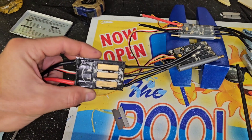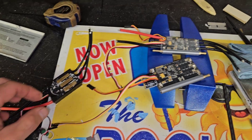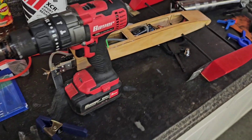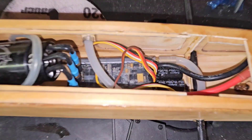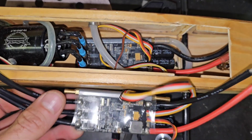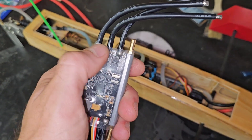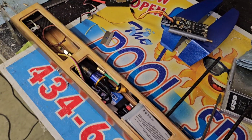I also had a Fly Color 90 with the cooling block removed — that's what Big B runs in his. In my main original rigger, that's the ESC I run. In this rigger right here we've done 91 miles an hour with it. I have the Kraken 120 in there and you can see just how different that setup is compared to a new one. I soldered the 4mm bullets directly to the board in these spots and did away with the wires.